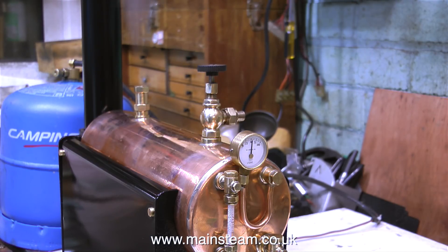You'll notice there are no finger marks on the paint — see how shiny it's looking. That's the heat doing that, but it's also baking the paint onto the metal. It's quite cold in the workshop today, well it was until I lit this boiler; now it's warming up a bit because all the doors are open. The smell in the workshop is horrendous — I knew this was going to happen. When you use cyanoacrylate adhesive for holding the insulation in place it really smells bad on the first couple of steamings, but once it sets it's not an issue.